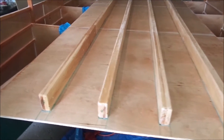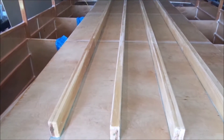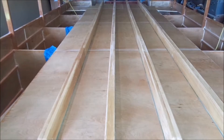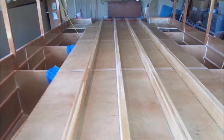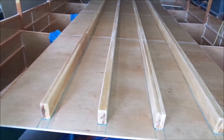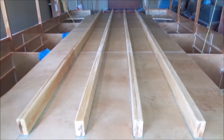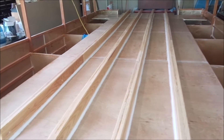I finished putting six ounces of glass on the bottom of the deck. I have the deck flipped over and also have the four 2x4 ash stringers epoxied and screwed on temporarily — I'll take the screws out later. The next thing will be to put a few coats of epoxy on here, do some fairing along the edges, and paint most of it before I flip it back over, since painting while underneath the deck would mean getting paint in my face.